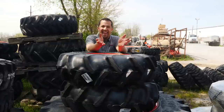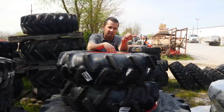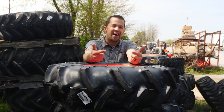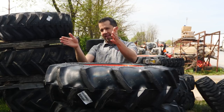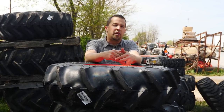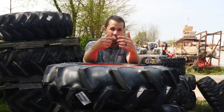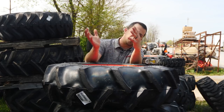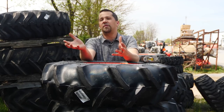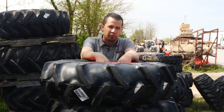There are a couple of different ways that you can mitigate this problem. The first is periodically rotating your tires. Most of the time you're going to see that skid steers wear their front tires faster, because that tends to be the set of tires that does a majority of the skidding as you're turning back and forth. Periodically taking those tires and flipping them to the back helps the tension on the drivetrain and also wears the tires more evenly, so you're not potentially throwing away a good set of tires without getting all the life out of them.